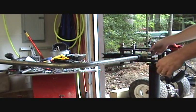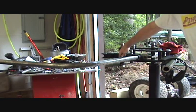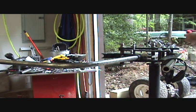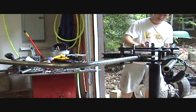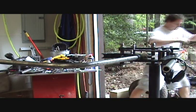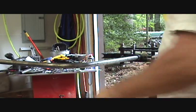So now I'm going to start bending it. I marked my tube here with the edge of the bending die, tightened it down so it doesn't slip, and I'm ready to bend. I made sure that the bend is on the side that I marked as an X, and a good old WD-40 to help it slide through the dies a little bit. Now I'm ready to bend.